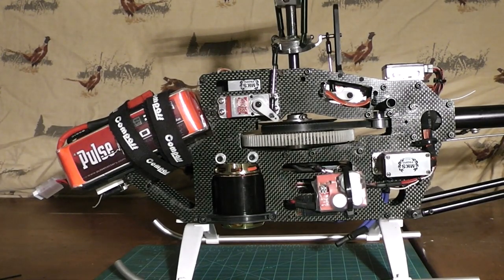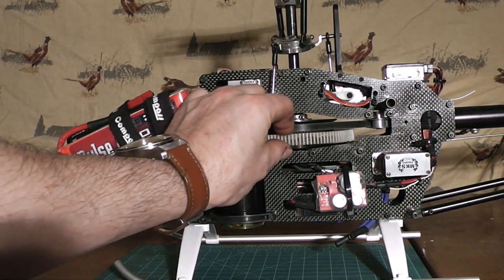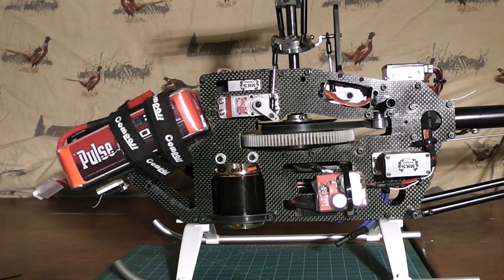If it's too tight even with the paper, I'd recommend going ahead and sliding your motor out just a little bit more. Spin the main gear around — make sure it's not hitting really high and then really low. Make sure that you've got a fairly even clicking all the way around. That's what you want — about that much — and you should have main gear success. I definitely learned my lesson the first time I did the main gear on this heli, and I just thought I'd share with you guys how I do it. Basically that's been foolproof ever since — I've never had another issue with main gear meshing. I've changed the main gear in this heli a couple times. So I hope you guys found this helpful — enjoy, we'll talk to you later.